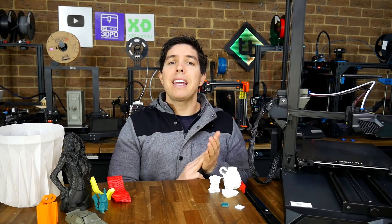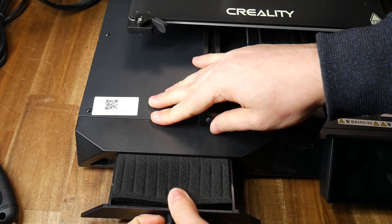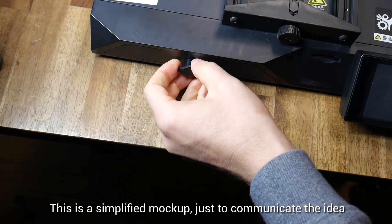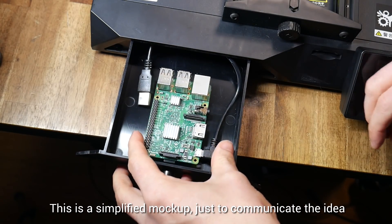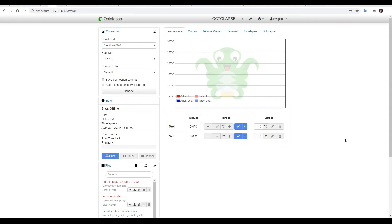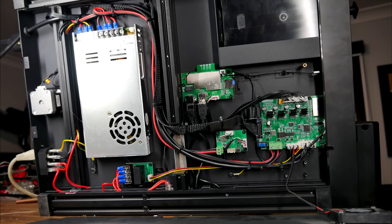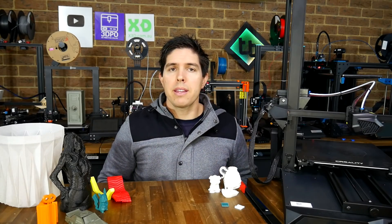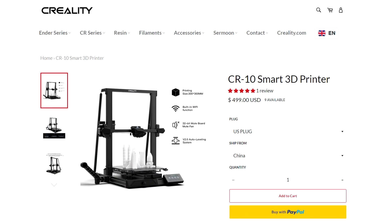Firstly, working ABL — that should go without saying. Secondly, fans that are actually quiet. And thirdly, a different approach to internet connectivity. Instead of having a Creality box on the inside, imagine an opening compartment like the tool drawer, but actually a dock for a Raspberry Pi, with a cable for a good 5V power source and a USB cable going back to the main board. That means we could easily run Octoprint, use whatever webcam we want, and have access to all community Octoprint plugins. I'd hope this would be cheaper to make since the user supplies their own Pi. As always, watch as many reviews as you can before you drop $500 on a new 3D printer.